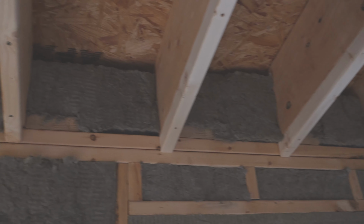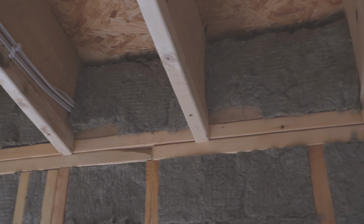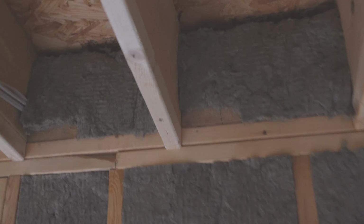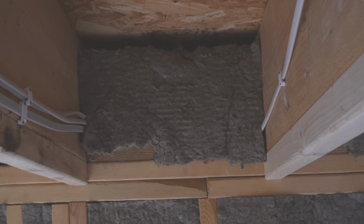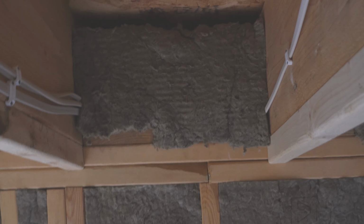To get started on the back half of this roof here, I'm envisioning a few different pieces that we're gonna make in an assembly line process. The first of which is this top of wall insulation, where we're putting a bevel on the top to sort of match the plane of the roof. That way our airspace is preserved, that 1 inch or so. You can barely see it, but there is daylight down in there. My camera's not doing a good job at all.